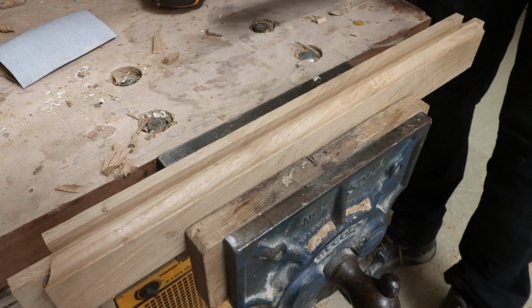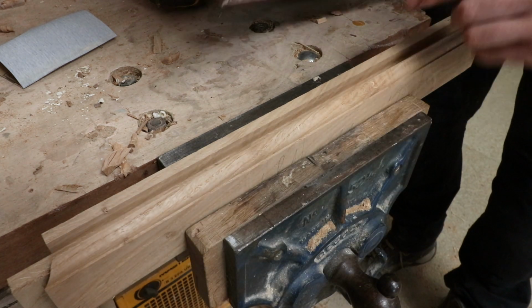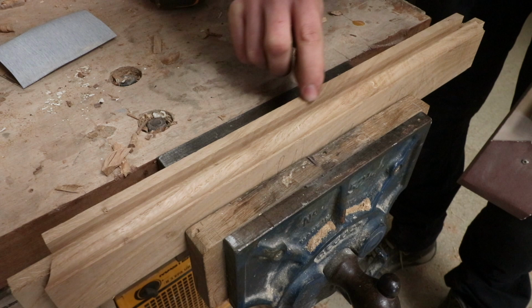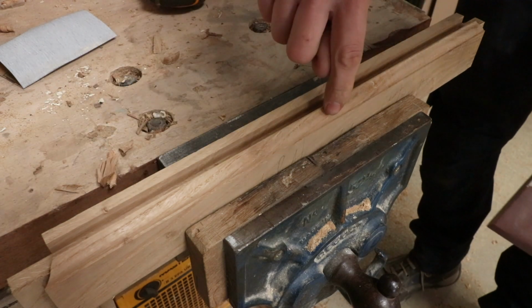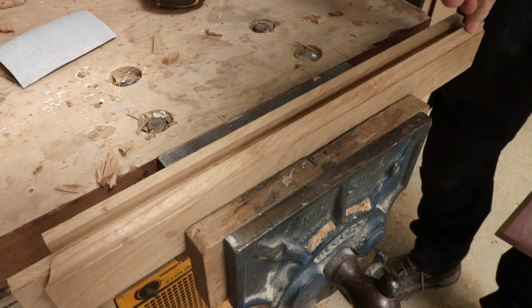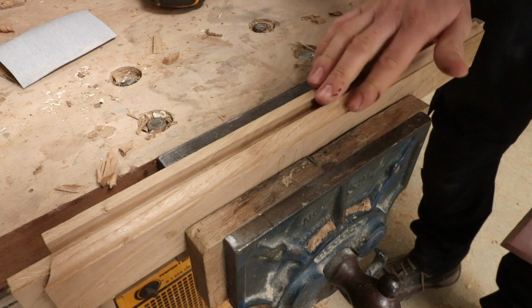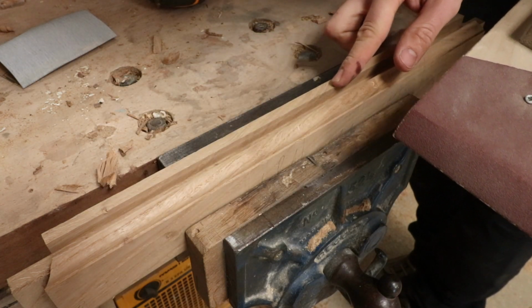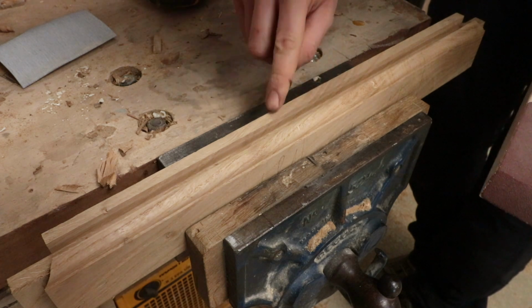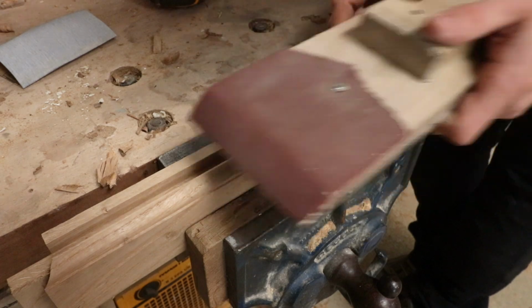We need to sand all the rails and mouldings too, so inside edges of the rails, which is this flat here. I know it's on the back of the door, but it wants sanding to get rid of them planer ripples, and then we want to sand this moulding off that we've machined in too. So this is the point at which you'll thank yourself for having really sharp cutters. Bearing in mind this has got to stay dead flat and straight anywhere there is a joint, using this edge as a shoulder, so this corner here has got to be real sharp.